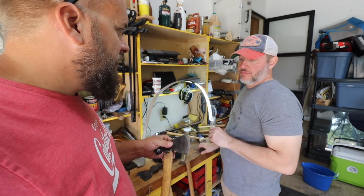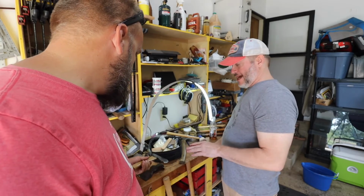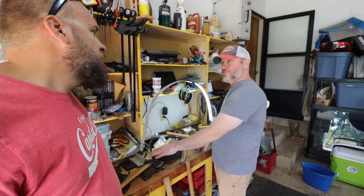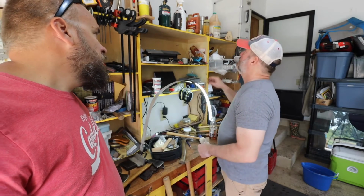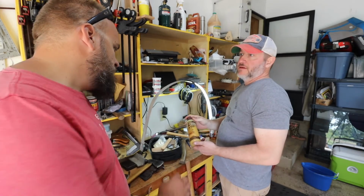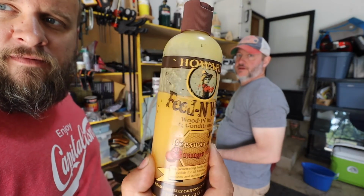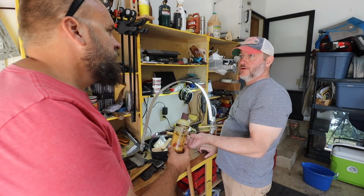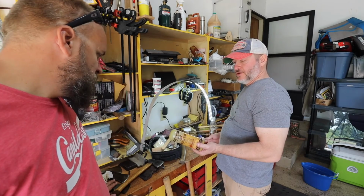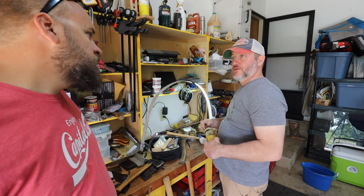And then you're using the linseed oil on the handles. Are you putting anything on the head as a protectant or anything? Typically, yeah, what I'll do is I'll wax the heads. I just put a wax over them. That's the easiest thing to do. And I actually use this, feed and wax. I use feed and wax on the steel. Pick that up at any hardware store. It's a great furniture polish. It's conditioner. You can use it on your handles also, but I like to put it on the heads because I just like to put a little bit of a barrier.